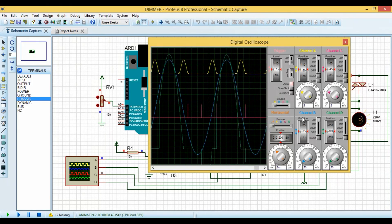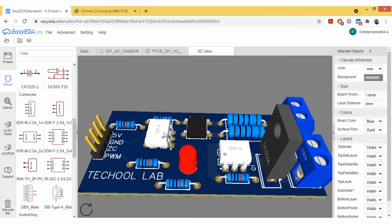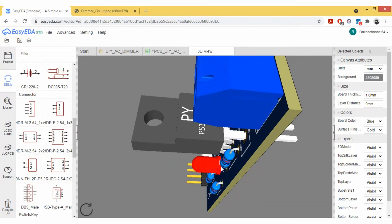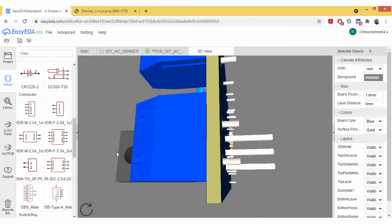Channel D is connected to the AC waveform passing through the TRIAC to the bulb. You can see in the graph that whenever we change the firing angle — the delay — using the potentiometer, we get a chopped waveform at the output. We have used this circuit in our projects and the Gerber file for the PCB design is provided in the description link. If you want to design your own dimmer PCB, you can watch our dimmer PCB design video. Thanks for watching — see you in the next video, goodbye!